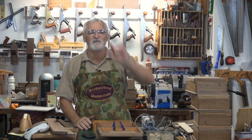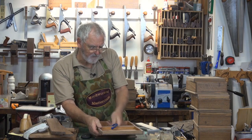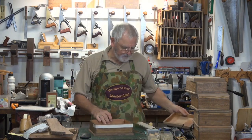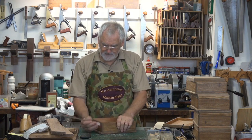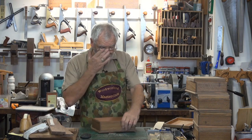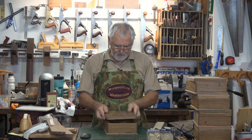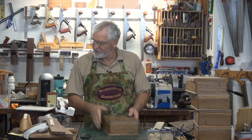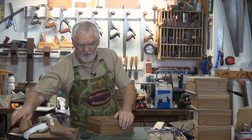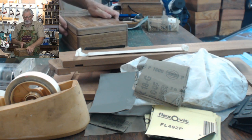What I've been asked, and what I'm going to start with, is how to fit hinges to boxes. The biggest problem people have with fitting hinges to boxes is the way they fit them — they actually preload the box. Which means when the lid is closed and it doesn't have a clasp or hasp on it, it will pop up like that, about that far from the top. You've got this gap here.